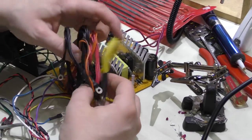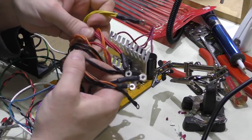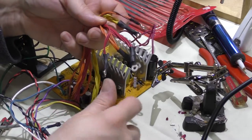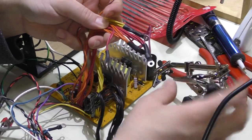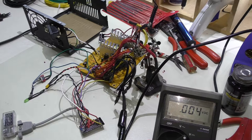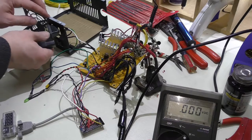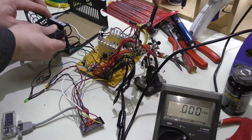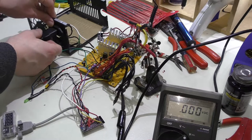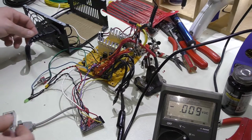I've removed the rubber band that kept all the power cables together — we're going to separate these out, put all the ground cables together, and keep the others separated with the helping hands or something so they don't short out against each other. The moment of truth is upon us. First I'm going to gently and carefully plug this in. I did put heat shrink on the back of this, but I'm not going to trust that to not short against the case.